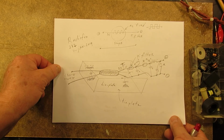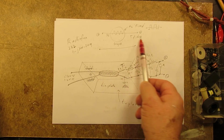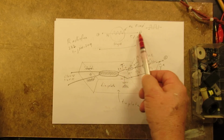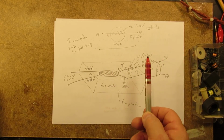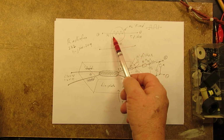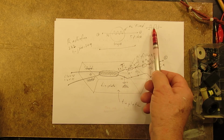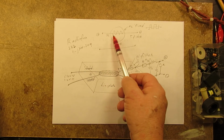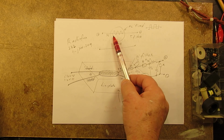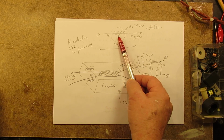So here is that circuit again, what I've told. You can see on the scope that DC and AC are on the same lead, the power supply lead. And of course, when the disturbing frequency has a very pure waveform, a square wave or a sine wave, it's easier to damp it out, because you can take advantage of the fact that you know the exact frequency.